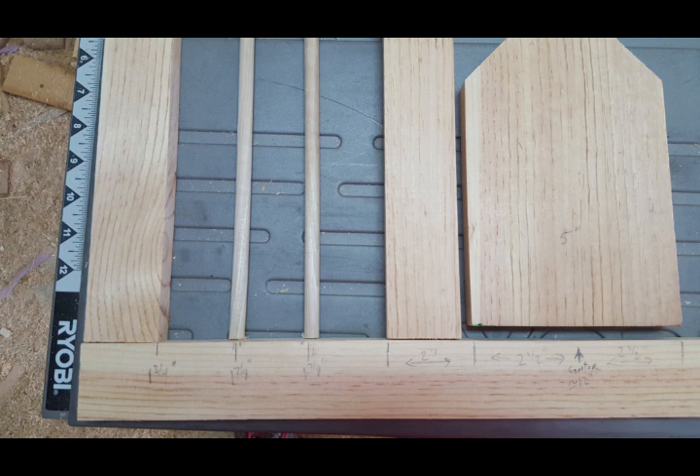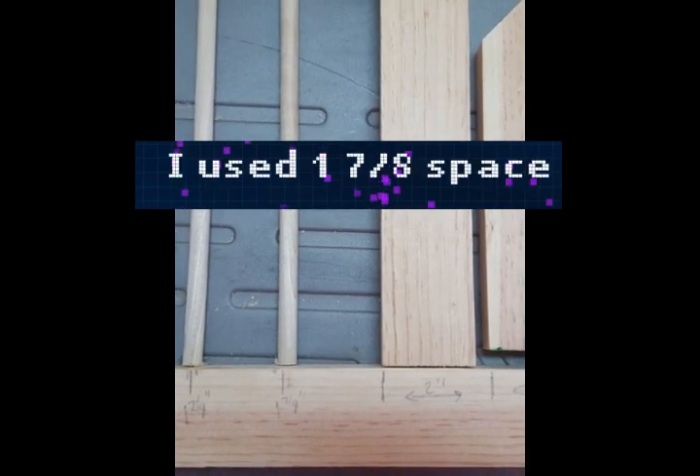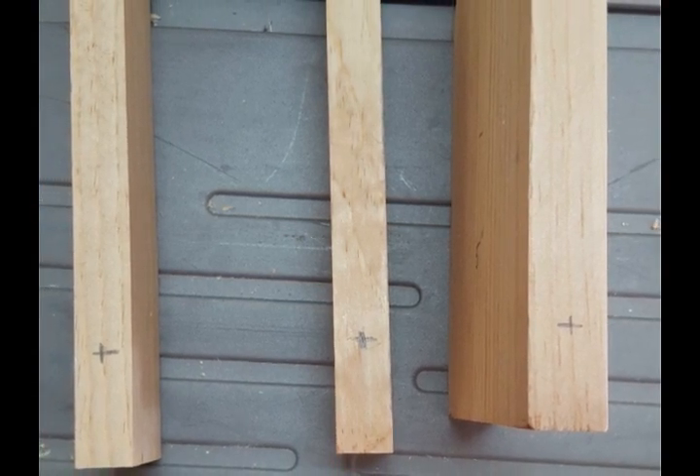This is how I spaced out one half of the nest front. There is about an inch and three-quarters spacing between the dowels and the uprights, and a one-quarter inch between the uprights and the door. I found that marking it out on my bottom rail made it easier to visualize. Next, drill into your 24-inch pieces about a half-inch deep hole.